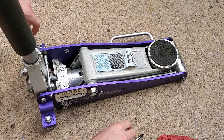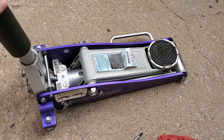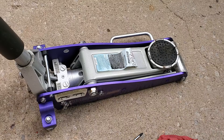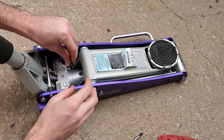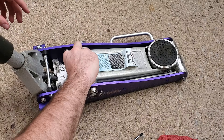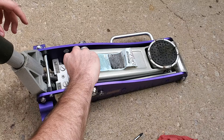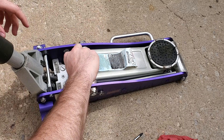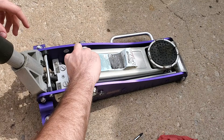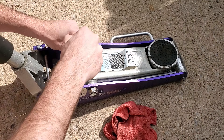You're going to want to wipe up any that you may have spilled, being careful not to get anything inside the bigger hole. Then we're going to bleed it one more time and some may come out. No bubbles — okay, that's what we're looking for, no bubbles. Then we're going to replace this bigger screw.